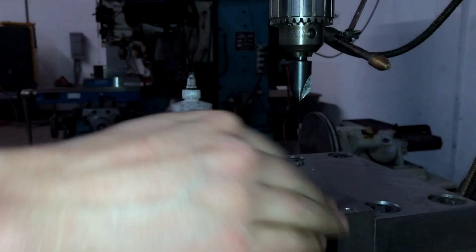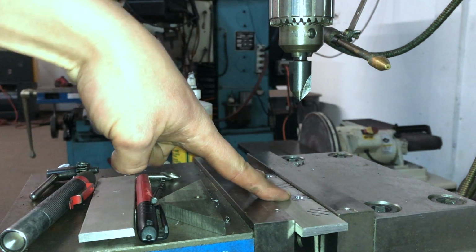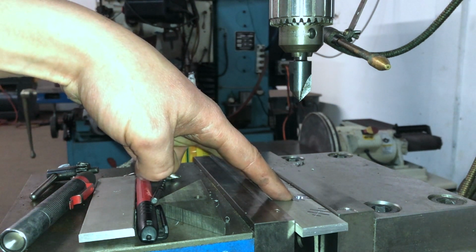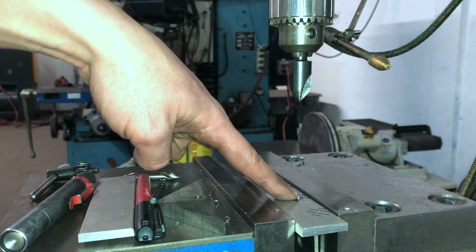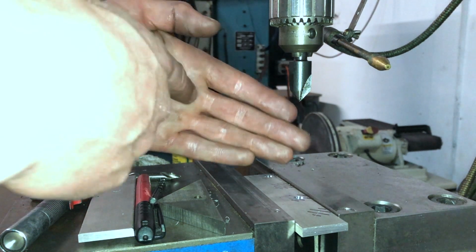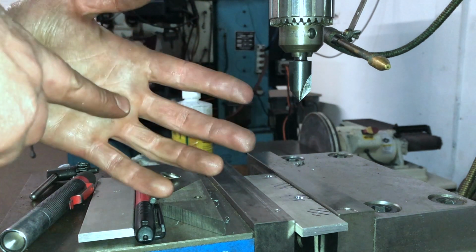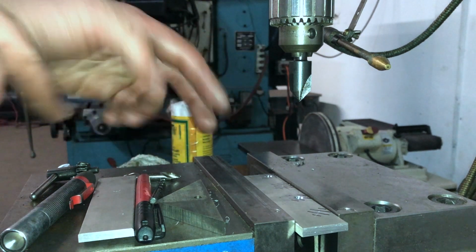All right. So we got our two through holes. Now, I'm not going to run the quarter-20 tap through just yet, because I'm going to lay this piece over the steel piece and just drill two quick little pilot holes with these over the steel piece, so I can get my through holes done in the steel piece and have those lined up with these.